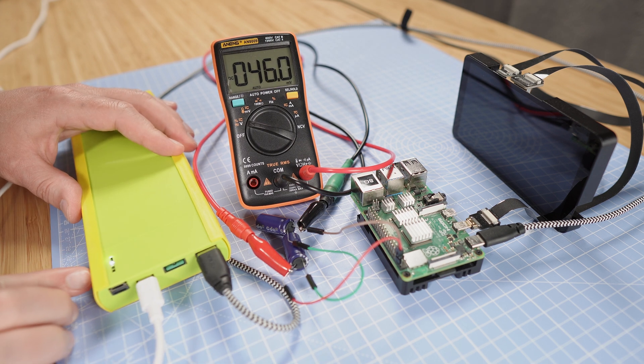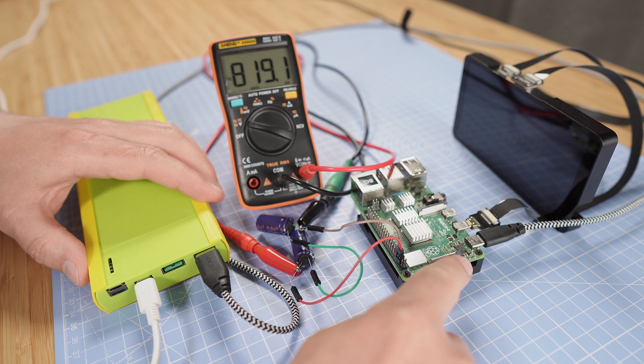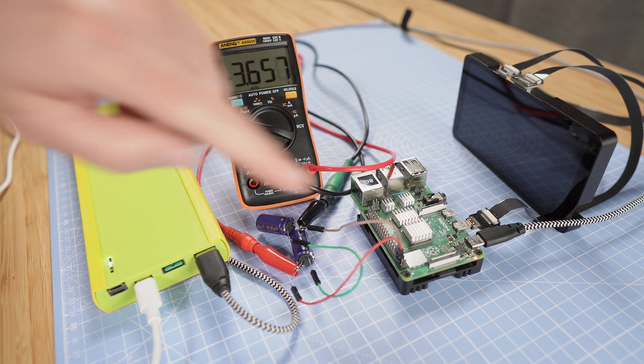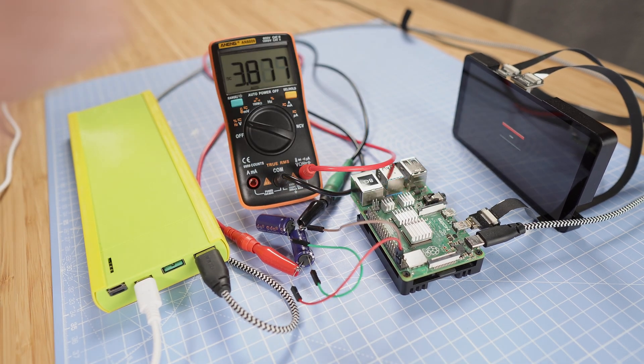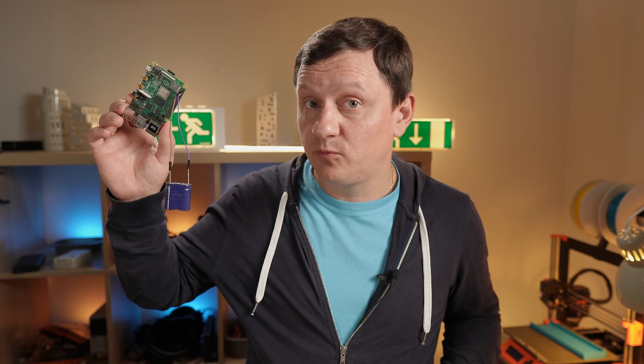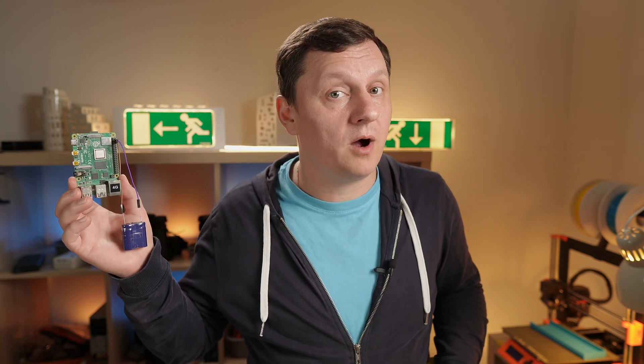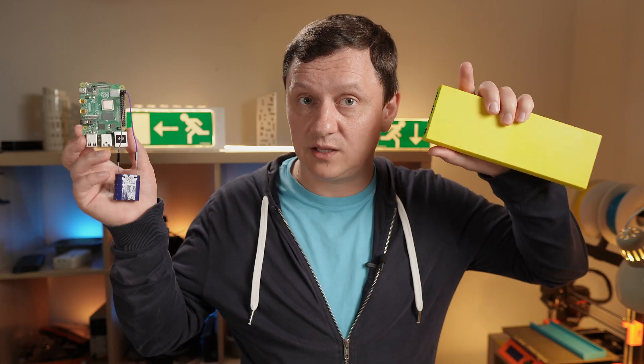While it's charging I can press the button, and it's starting to blink. Now it's growing very fast and soon Raspberry Pi will start — yes, it's starting now! This idea with supercapacitors works. I was not expecting that supercapacitors are so greedy and consume all power until they're charged. I also was not expecting that the powerbank PCBs will charge supercapacitors for only a very short time, requiring me to press the button multiple times — but that is not an issue if the supercapacitor is charged and always connected to the powerbank.